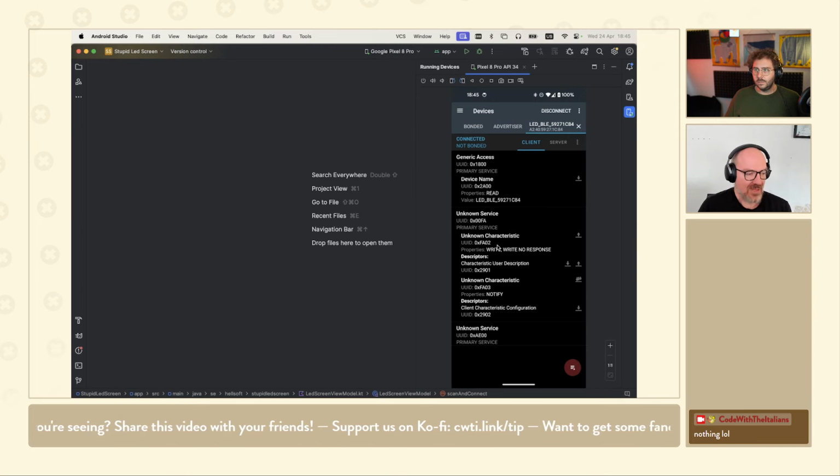So first of all, characteristics are like the endpoints you talk to, like the inputs and outputs. You can write to them, you can read from them, and some of them you can subscribe to, depending on what properties they have. So this one, here we have the ID for that one. It's unknown because it doesn't have a well-known UUID, so it ends up in the space of custom-defined characteristics for this device. The properties for this one are that you can write to it, and you can write to it with no response. They're two similar ones. Regular writes in Bluetooth GATT mean that you write and wait for a confirmation that the write was received and you get a response back. Write with no response is basically fire and forget.